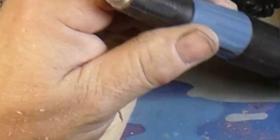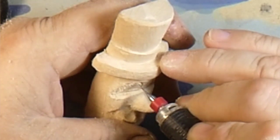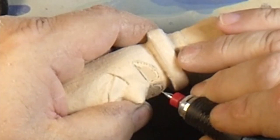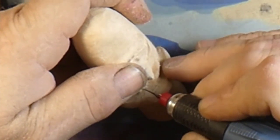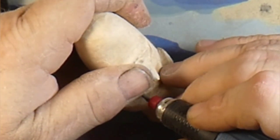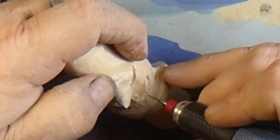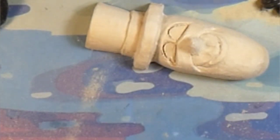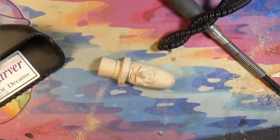So we've got some of these little tiny drill bits from Harbor Freight — these are not carving burrs, they are drill bits, but they are carbide and the very ends of them are very sharp. I like using the very tips to dig in and cut lines a little bit deeper, because the very ends are good cutters. But don't try shaping with these or using the sides of them — you'll just break them. Just the very tip is what we're using here to make the lines stand out.